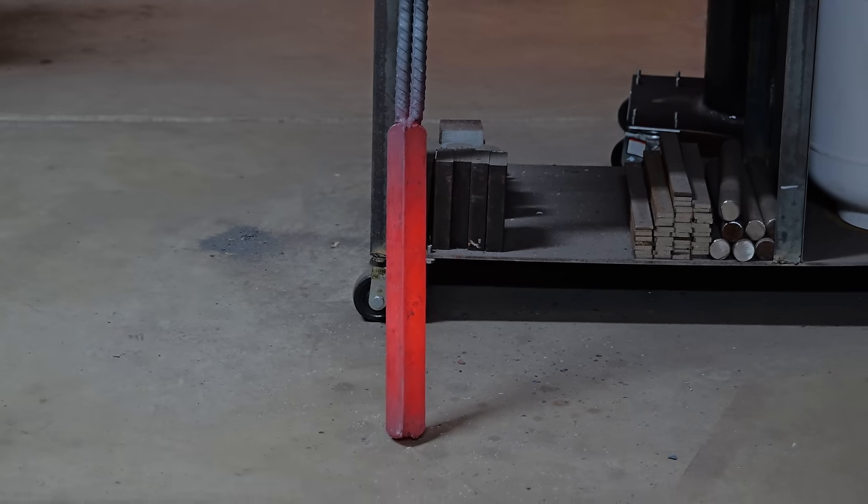After finding an orientation I like, it's time to take it back to the welder and weld up my third-to-last billet. Every single weld I've done on this channel so far has been with a Lincoln flux core welder — I swear this summer I'm gonna get myself an actual good MIG welder. I'm honestly kind of sick of throwing disgusting beads purely because my welder just isn't that good. All I have to do for this billet is draw it out and get it ready to cut up into another four pieces for the final four-way weld.